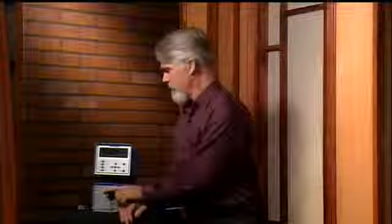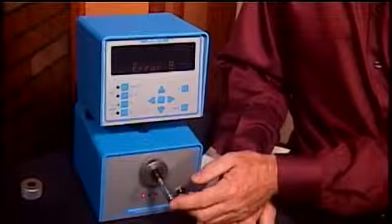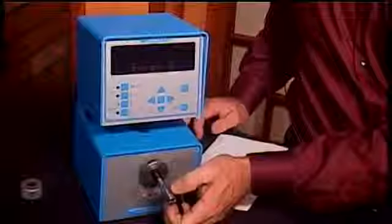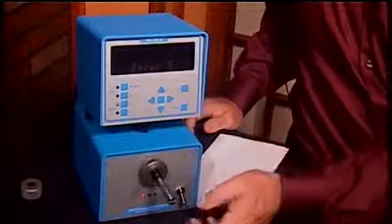You can't see it, but coming into the back of this box is compressed air, 60, 80, 100 psi, not sure what we're running at right now. And coming out the front of the box, as we can see right here on our gauge cam, is the gauging member. This is the business end of the air gauge. And what you can't see, there's two little orifices in this. Now this particular gauging member is going to be set up to measure inside diameter.